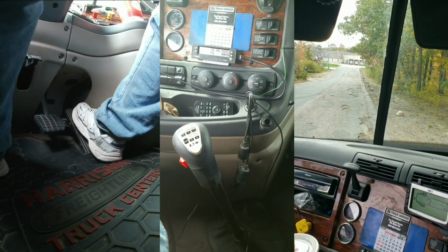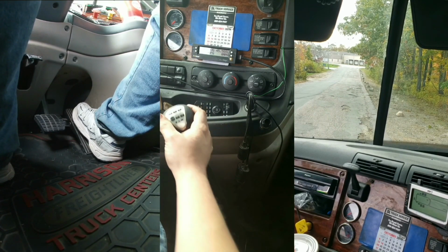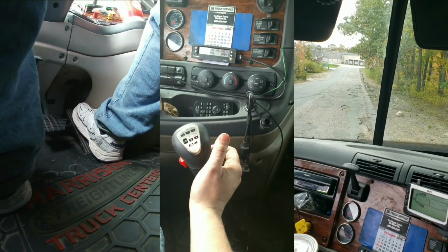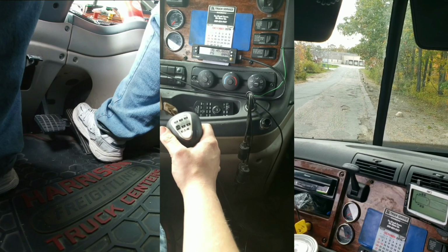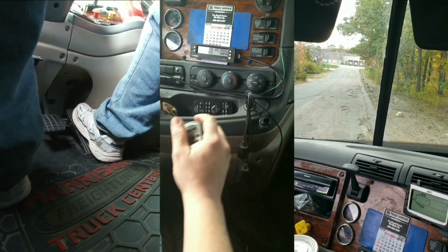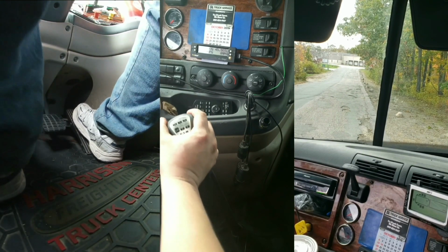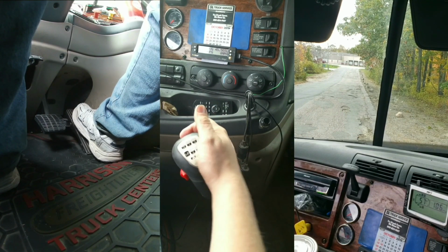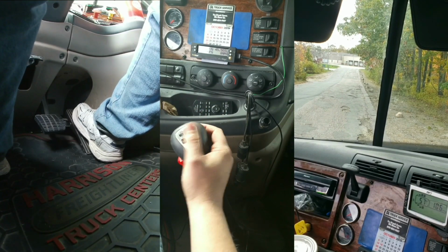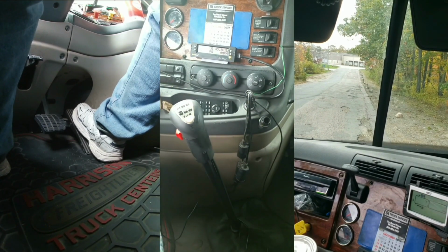We're going to get into the clutch brake. At the end of every clutch in a semi-truck, there's something called the clutch brake. And that actually allows you to go into gear really nice. Because if you don't, well, we bring it back up, or come down. Otherwise, you hear that grinding? That's really not awesome. That actually kind of hurts my soul a little bit. Not enough clutch. So you go down to the bottom, you hold it, you count for a couple of seconds, and it goes bam, beautiful right in.